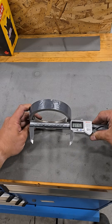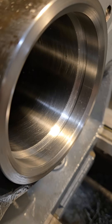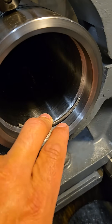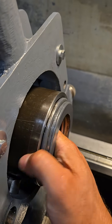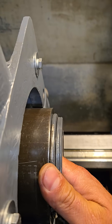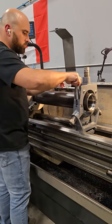This first part of the groove is actually just getting the exact dimensions I want for that ring. I kind of fumbled a little bit trying to get the exact correct dimensions — showing you a couple different ways I tried to measure it out, but I got it. Unfortunately, somebody forgot to make a video of me machining the lead-in on this thing, so you'll just have to imagine how awesome it was — which was incredibly awesome. But I'm pretty happy with that. It's got a nice 90-degree shoulder on the back side. And as far as the best advice I could give you: don't put the end gland into the cylinder, or it will be stuck for over 30 minutes.